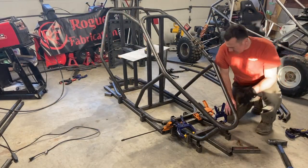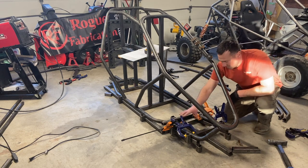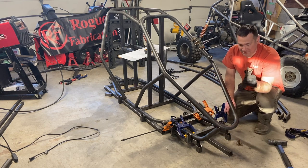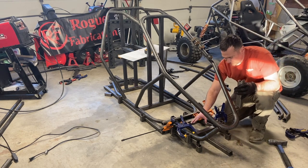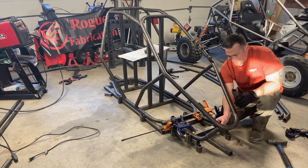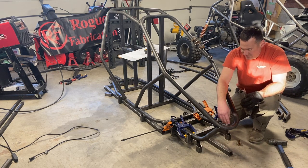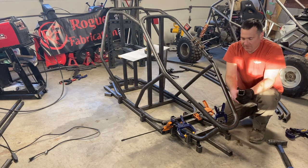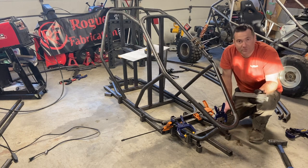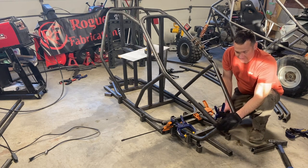This front end has to be squared. We know the jig is squared, and these two rails are actually boxed, whereas the front piece coming off of it is just a single post that we squared the best we could, and this has a notch in it. These were sitting into the rails just fine, but I couldn't get the front bar low enough in the notch to get these bars lined up — it was just an eighth to a quarter inch of a gap. What I ended up doing was just knocking it out, laying this down on these two, and everything is completely square in the front end, with these cradled nicely right in that notch.